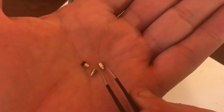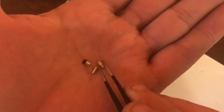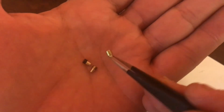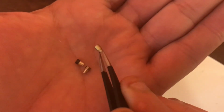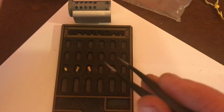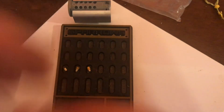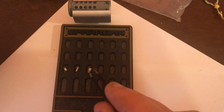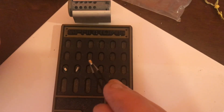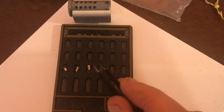So just stop, take a look at it. If it is coning, just kind of readjust a little bit how you're shaping it. Hit it a few swipes, go back, look at it again, and you see you're evening it up. But it is very easy to be making them where they kind of taper instead of being a little more straight and level. Now, being a reduced diameter pin, the odds are it is going to be the last pin to finish, especially if it's your thinnest one in there.